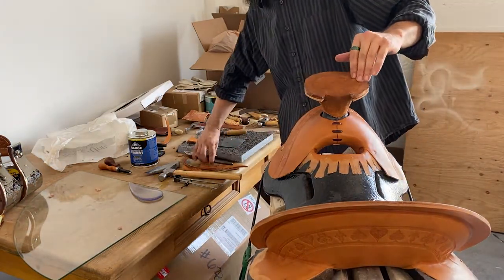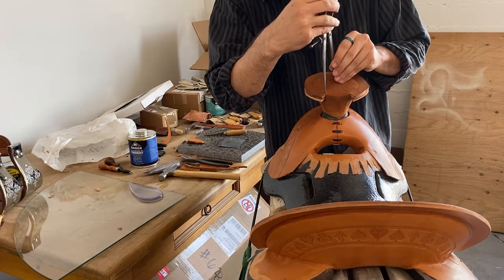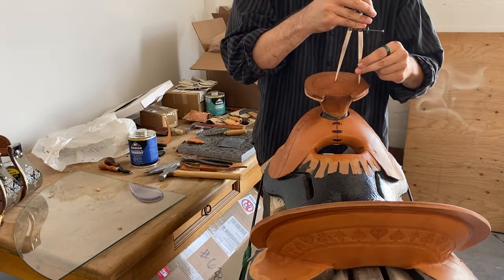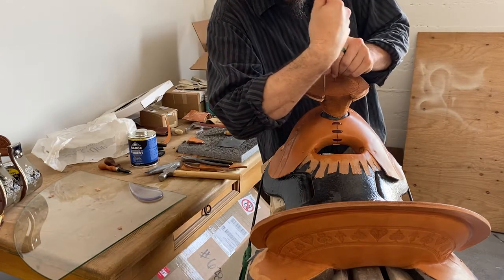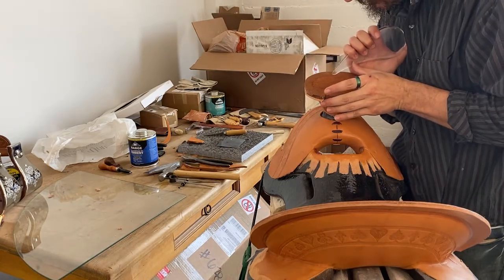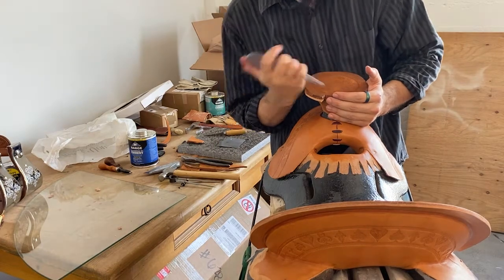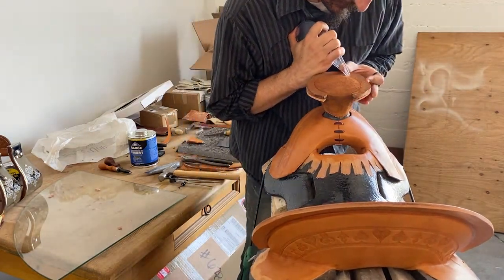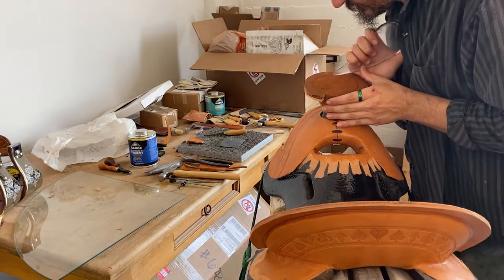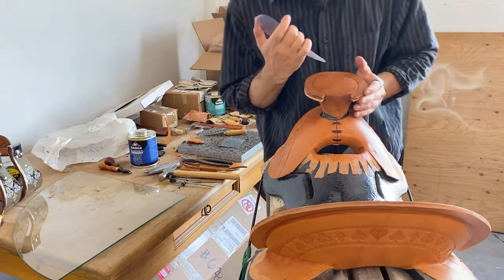Okay. So on the inside of that line, I'm going to go back to our dividers. We haven't changed that distance. We're just going to run around again, and we should now be in the center of that line that we just created. And if you need to tickle it one more time, do it one more time. On the second pass, I usually try to, and this is where you're going to really make that indentation.